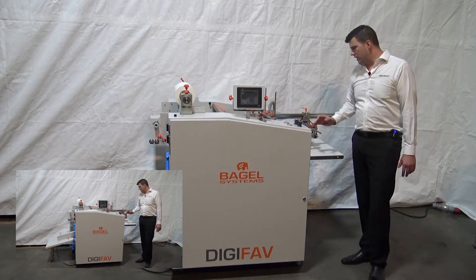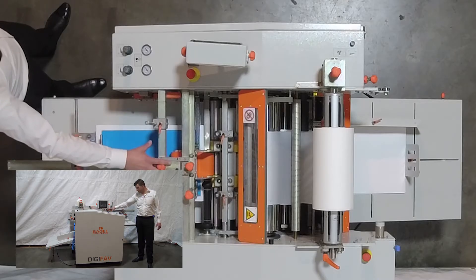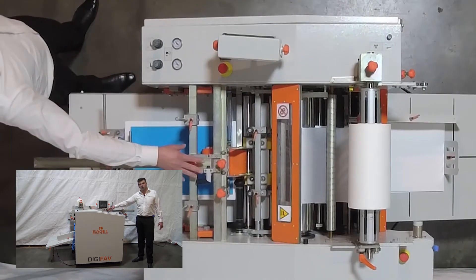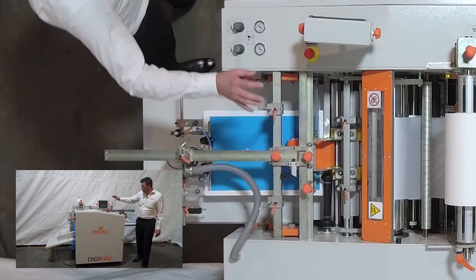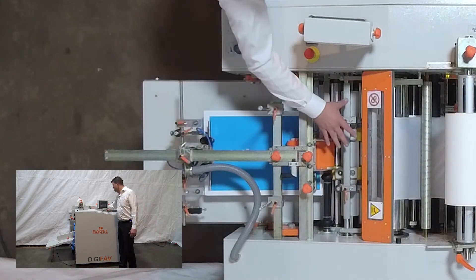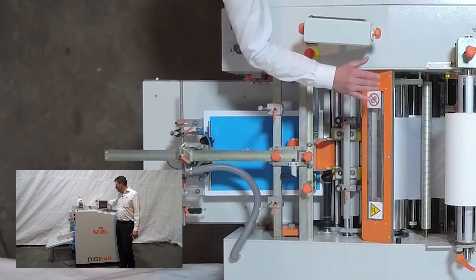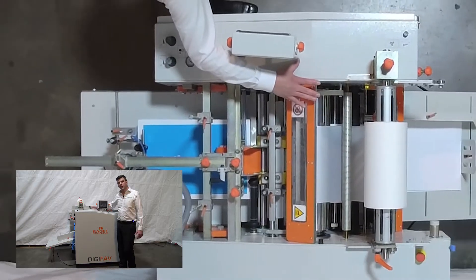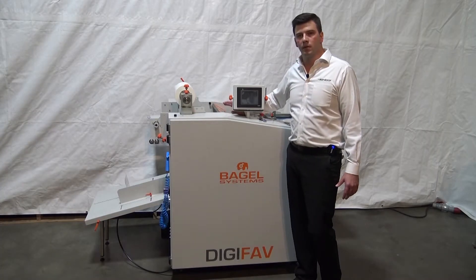It's unique in that it has a dual feeding head system — a very efficient feeder which we'll get into more detail on momentarily. It also features a positive paper traction system, best in industry for accelerating sheets after they've been fed, and a nip roller system that contains an oil heated roller with a high pressure nip roller on the bottom.